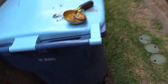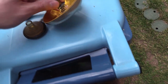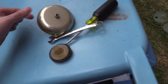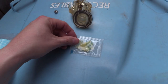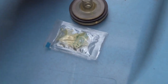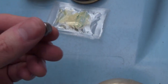Let me show you the old parts here — got them on my garbage can. This is the old poppet and this is the old top piece. This brass piece right here is kind of the bell. What they send you in the kit: some food grade grease to create a tight seal, and then you've got this little housing piece. You can see the little black O-ring — that's where I'm going to put the grease. And this is the new nut; it's an 11-millimeter.